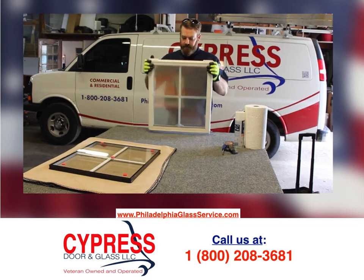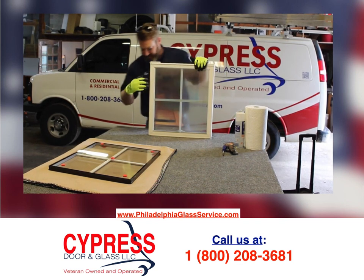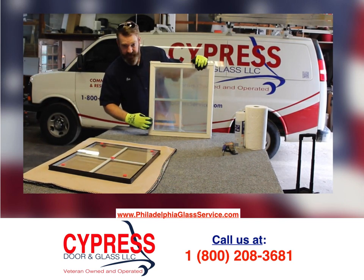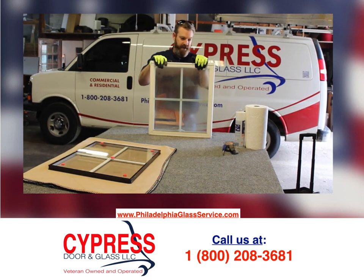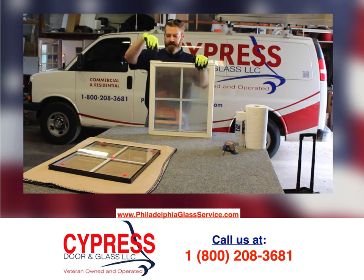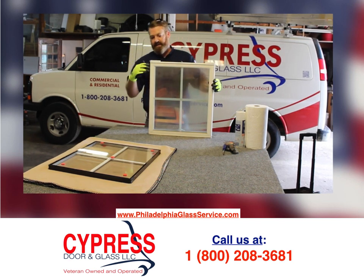What we have here is a vinyl residential window sash, and the glass is held in one of two ways. It either has a glass stop — you can tell by the seam that goes around it, and you can have this on the inside or the outside — or you will have a screw holding these four sections of framing together, and that will be accessed from the side.